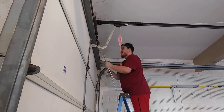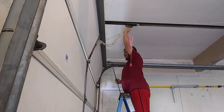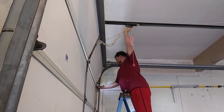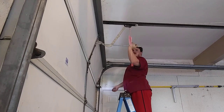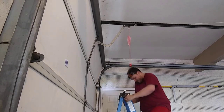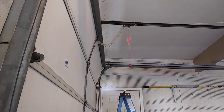You want to make sure you have cables attached because you use them. When you lift up, raise the door up, I can put my scale under. If you're wondering why your weight is up — isn't that back-unwinding the springs? Well, not in this case. In this case, you'd be winding it because it's low headroom, so I'm using the outside pickup.